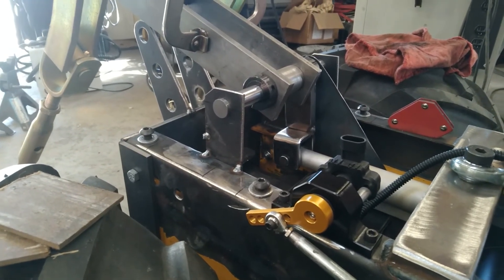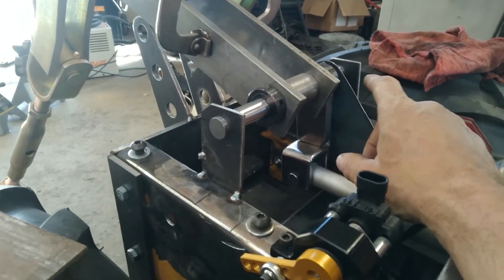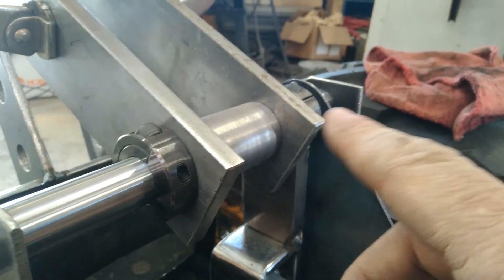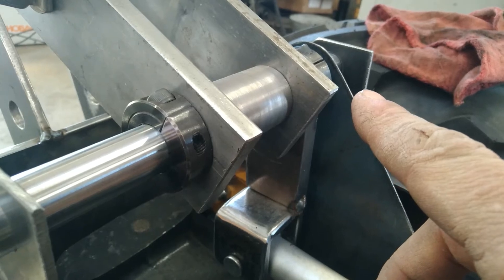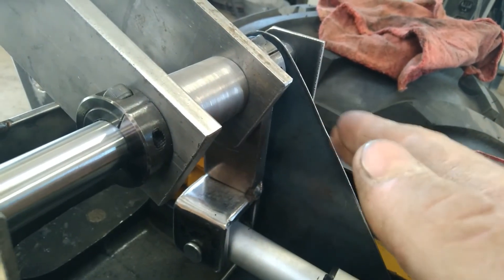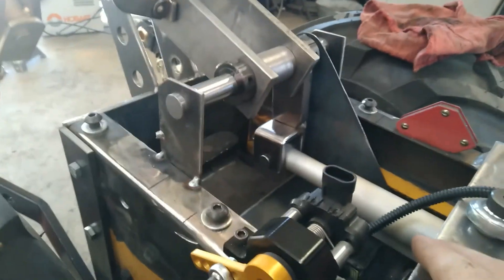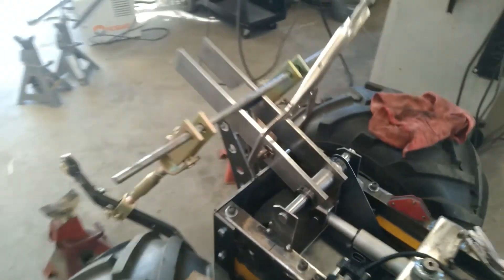I don't have a way of drilling holes big enough — I think I'm going to need a one-inch hole up here to put the bushings in. I'd like to get more precise measurements because the distance from the centerline down to the bottom is kind of critical. The process will be: drill those holes first, put the bushings in, then put the template over this and cut the lines a little fat, do both pieces, clamp or weld them together, then trim the outside dimension so it looks good. I can't drill those holes that big here, so I'll do that at work after hours. That's what it is now — I think it looks pretty cool and I think it's going to work really well. Thanks for watching.